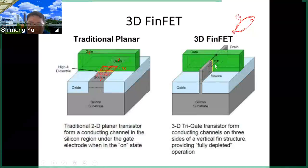This part is still silicon — the gray region is silicon. Now the silicon is no longer a planar structure. This fin is standing out from the substrate, so you have this fin vertically on top of the silicon. Still this side is a source, the other side is a drain, and you still have the gate here.